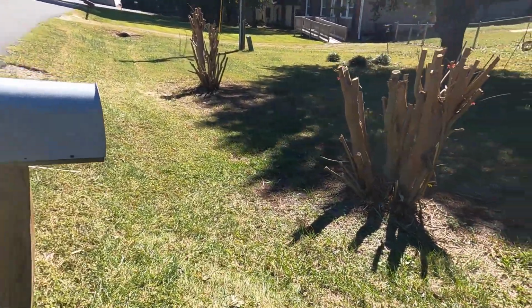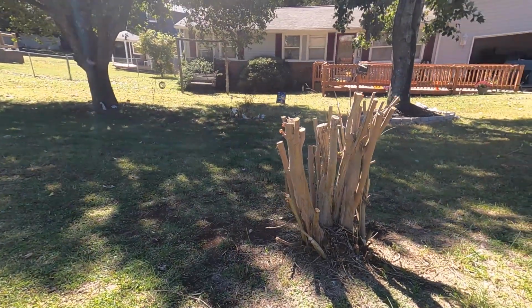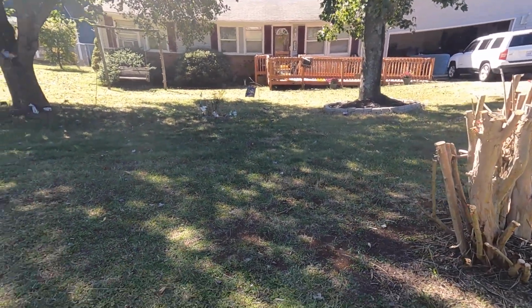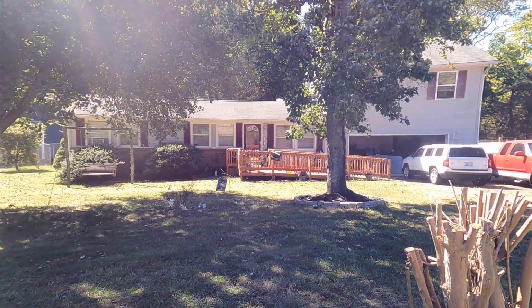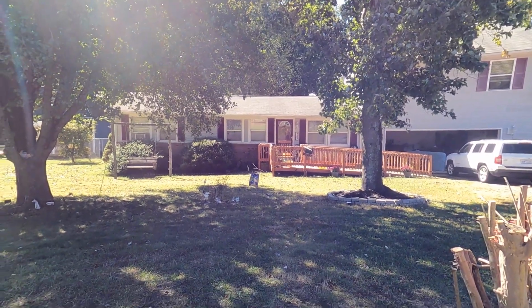So as we look at this house from the front, you can see there was a swale, the culvert system out front, that does catch a lot of water. But look at the negative grade at this house, and that's why the crawl space is wet. So we need to address that issue as well as put in a real channel drain across that front.